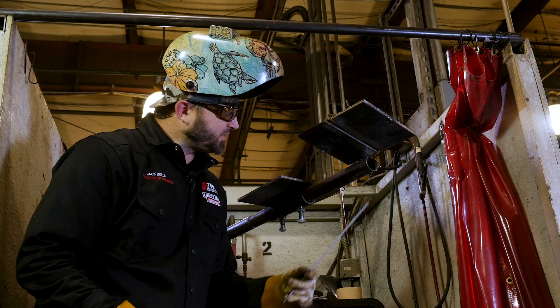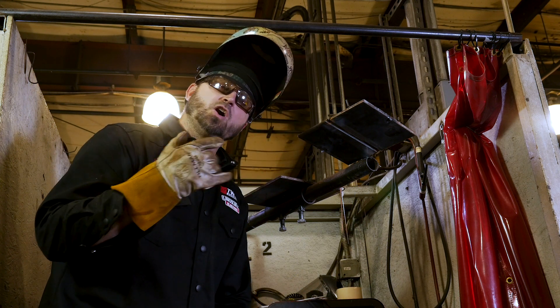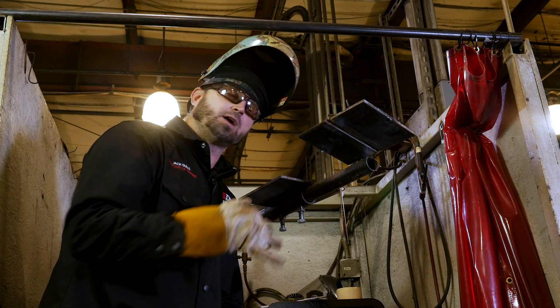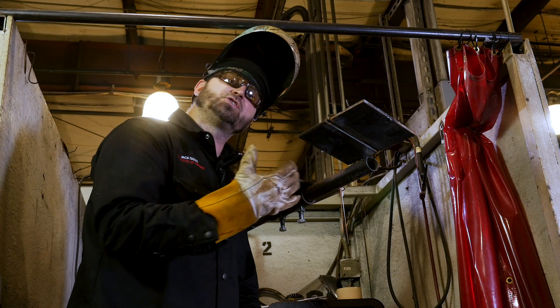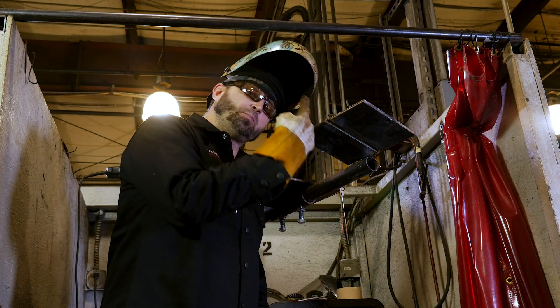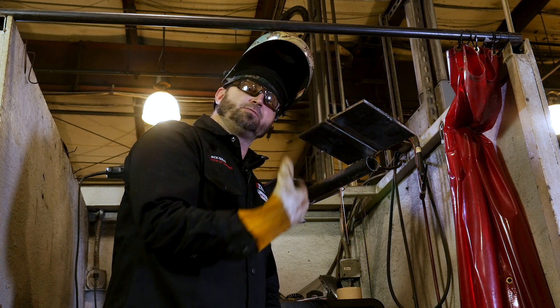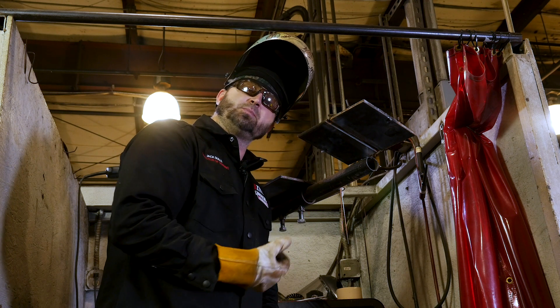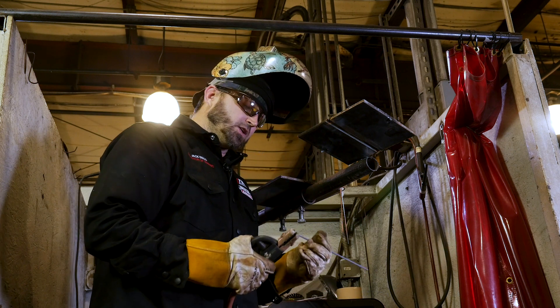We're just going to put it up in there nice and tight. When you're doing the overhead, you got to keep it buried up in there — you're almost trying to push it out the top. Don't push it out the top, but you're trying to get it right up into the top because you want to get that penetration and get that build-up in the back. The only way that's going to happen is keeping it pushed all the way up in there. If you start to long-arc it, it's going to fall and rain fire down on top of your head, and you don't want to get burned. So keep that fire up in there.